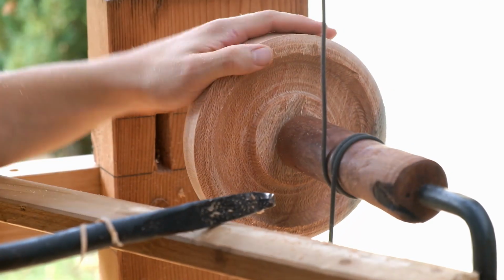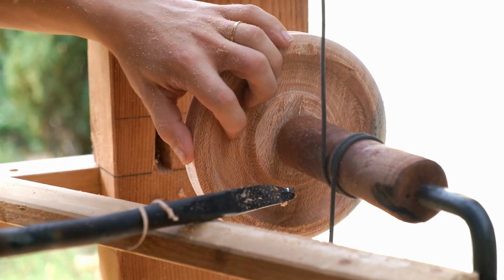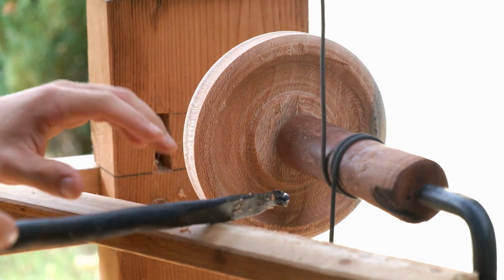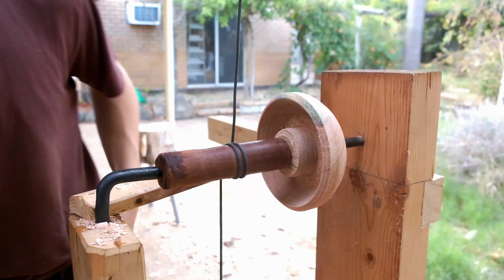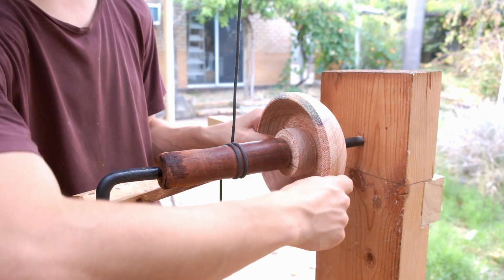I've figured out that, for me anyway, it's better to sort of create a channel and enlarge my channel as I get deeper, rather than trying to cut away the whole surface of the bowl on every single pass. So I've done a little bit off camera. I've started hollowing out the bowl, which we'll finish together.